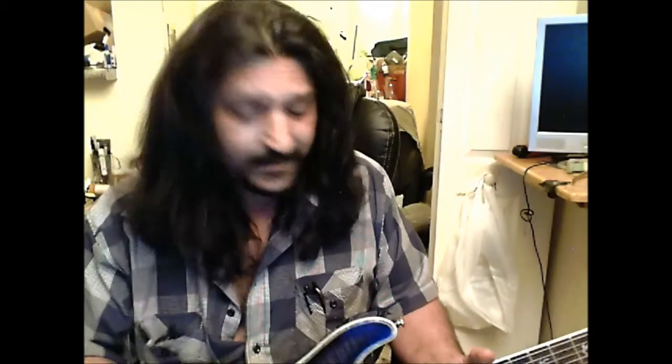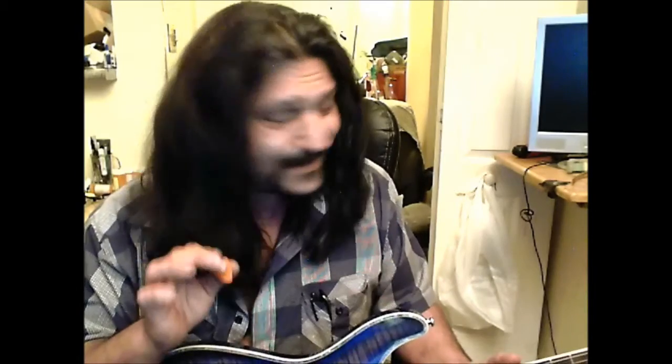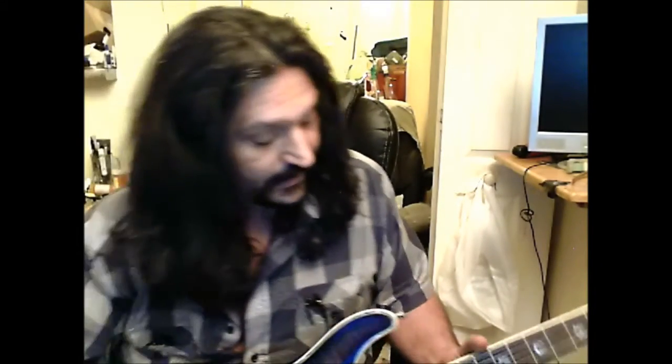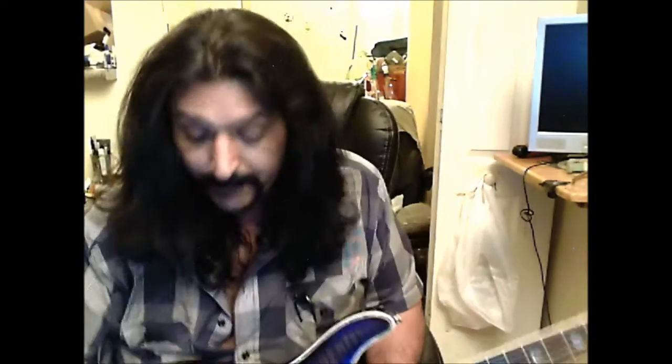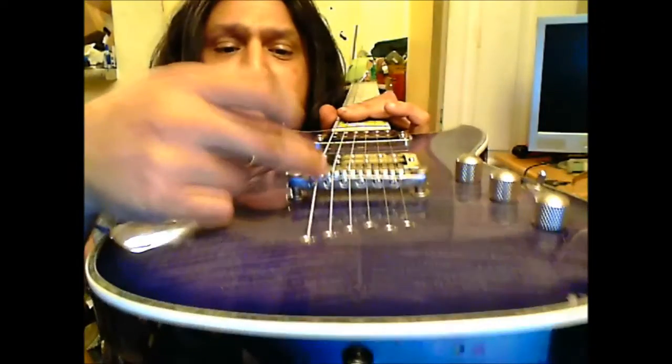Now, in this case, the harmonic is on, and when I fret the note lightly, because if you press it too hard, it will go sharp, just enough to fret it. It's a hair sharp, okay? So, being as that it's sharp, we take a small Phillips, and right in there is the screw.